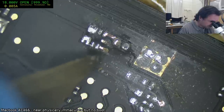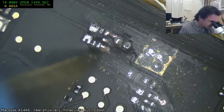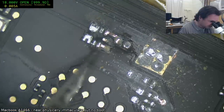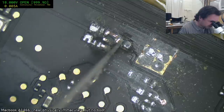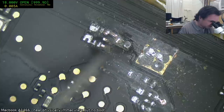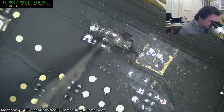Yeah, that via is okay. We've got a bit of copper there. It might be viable. You can't always tell. Sometimes you just get a bit of uncorroded copper, but you scratch out a little more and it vanishes away. So there's no guarantee the top of the rest of the stalk is viable.